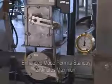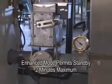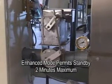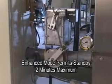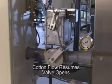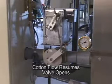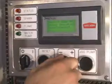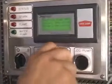While the pump runs, the main water valve closes to minimize water spray and moisture output. This keeps the spray chamber from overheating due to the sudden absence of water pressure at high fire. It also provides faster resumption of moist air output if the pause in ginning is brief. The mode of operation can be changed by using the diagnostic and test routines described in the service manual.